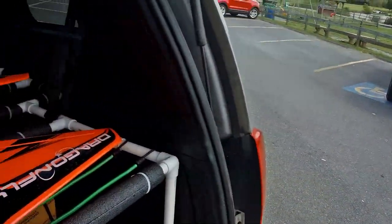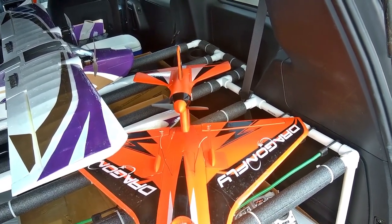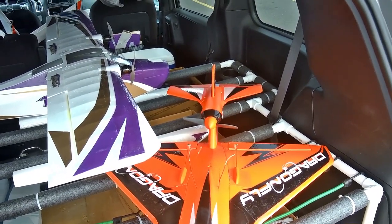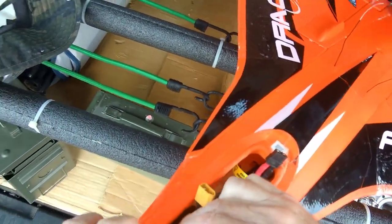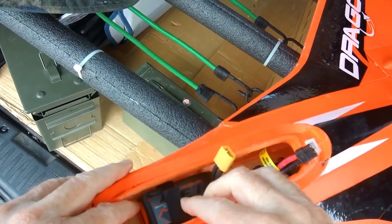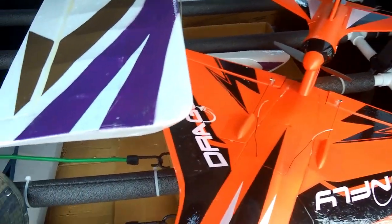All right, this time we're going to fly the Dragonfly, which is like the Hobby King Skipper. That's this one right here. And it uses a 1300 milliamp hour three cell battery. Put the battery strap on it. I don't think that would fall out of there anyway, but just to be on the safe side.